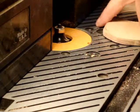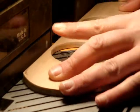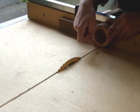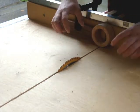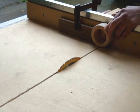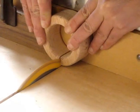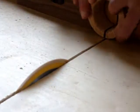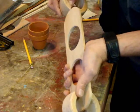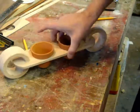Now I'm just easing over the edges of the top panel. What I've done is set up a stop block, and I can line up my circle and cut out a groove where that panel that holds the pots will sit — it will take a couple of passes to get it through to ¼ inch thick. Now I can wedge those in and see how it's going to fit. Both of those circles are going to fit in about like that, and with my pots they'll sit in about like that.